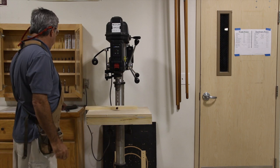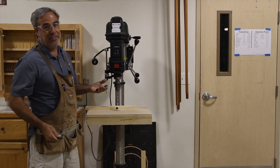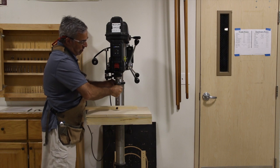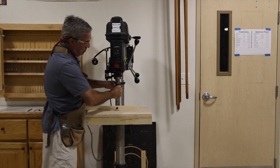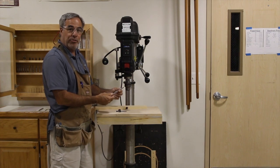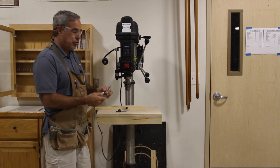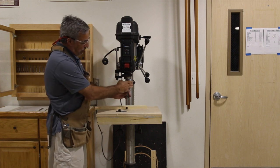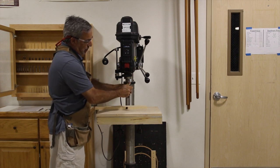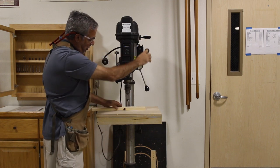If you are going to drill with a larger drill bit, you are going to take the chuck key and put it in the drill press and loosen it. Loosen it by twisting back towards yourself and it will loosen the bit so that you can take it out. Now if I am going to use a bit that is at least one inch or larger, I need to first adjust the jaws of the chuck, get my drill bit set in there, tighten by hand, set my chuck key, tighten it up, and then get this all set up.